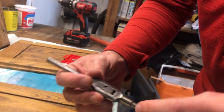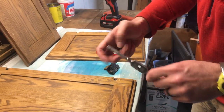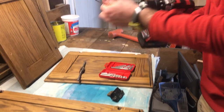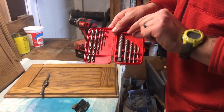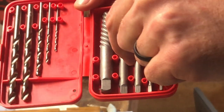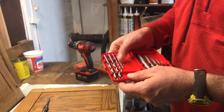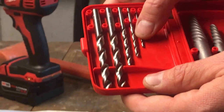This is your tap wrench — one handle loosens and tightens the jaw. It lets you apply force symmetrically so you're not torquing too much on one side. This goes back into your screw extractor set. These have a left-hand thread, so you're driving it down counterclockwise. When the conical section bites into the hole, it removes the screw counterclockwise. A lot of times the drill bits in the set are also left-hand twist, so make sure you check your drill bit and if so, put your drill on reverse when drilling the pilot hole in the stuck screw.